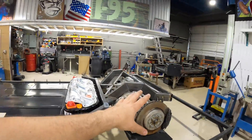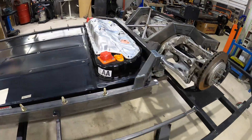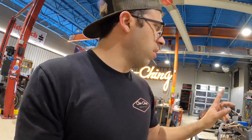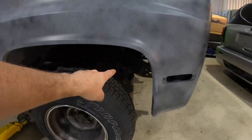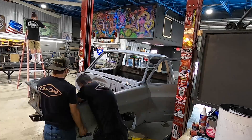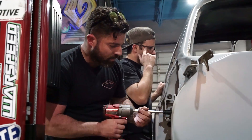The electric chassis is finally doing the electric slide. Front and rear chassis are all welded up, supports are in, everything's bolted down — this thing is about 95% there. We still need a rear sway bar, front sway bar, and some suspension work, but first we're hanging the cab. Andrew is over there getting the cab ready to remove from the old Chevy. We've got to pull the doors, hood, front fenders, and core support to strip everything out, then slide the electric chassis underneath and start fitting the cab on top.